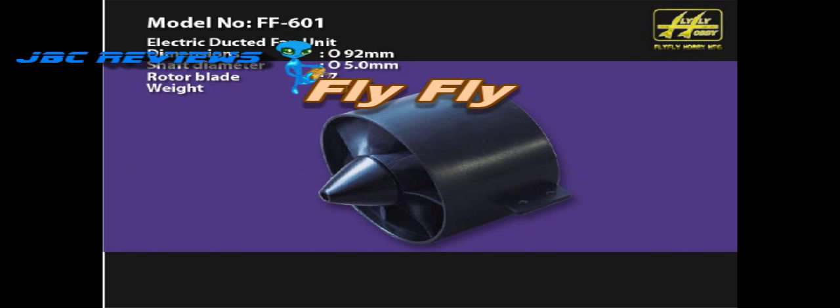Also, it balanced pretty easy, pretty much straight out of the box. It required very, very little work, and it ran quite smooth. So, in saying that, I'd have to give the WeMoTec my vote for first, because it didn't need a lot of work at all. It balanced well, it sounded good, and it was quite strong and provided good thrust figures.